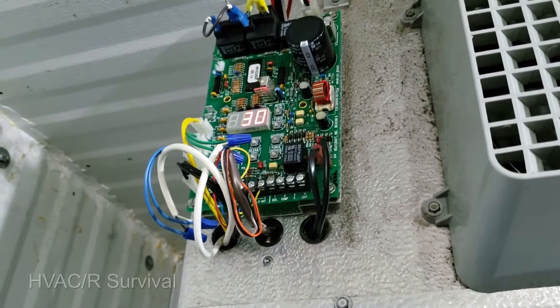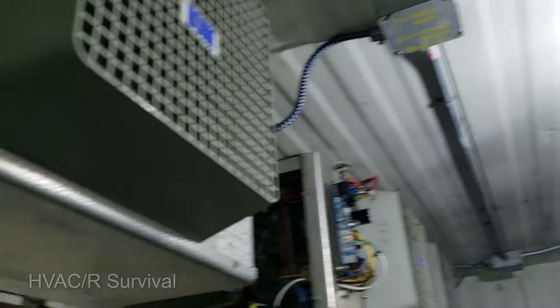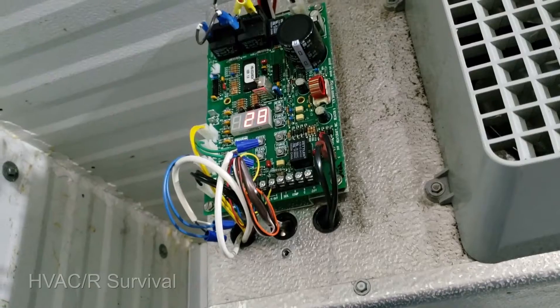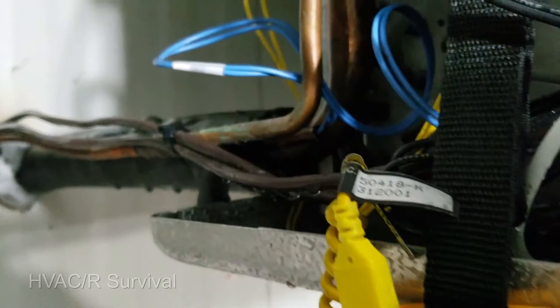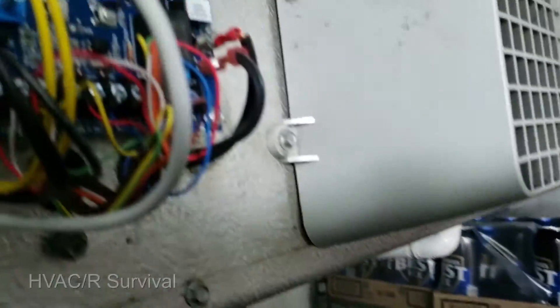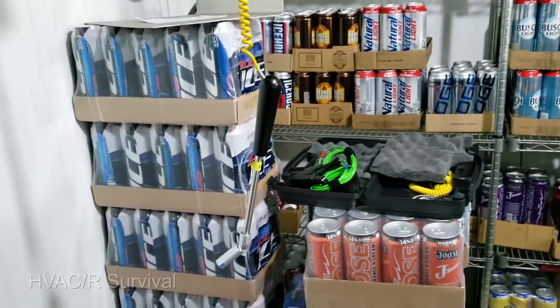That one kicked on. The DFT is dropping. I'll lower this one back down to 43 to match. Neither one of them had any buildup of ice, so they've been defrosting fine. Basically, we were just talking through it and figuring out what's going on. We just weren't sensing temperature correctly. I don't think anything more important is going to happen with the rest of this job.